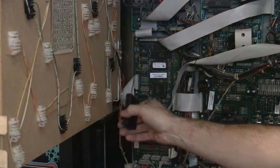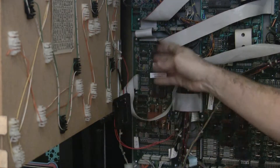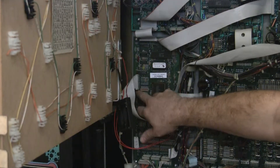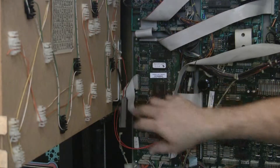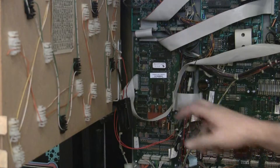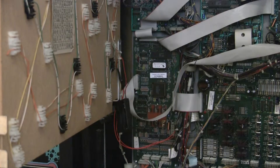I've got my remote battery pack here and we've got the board plugged in. If there's any confusion when you're plugging in these ribbon cables, you'll notice that there are numbers at either end — either it'll say 1 or it'll say 23 or 24. The red line on the ribbon cable always corresponds to pin 1, so if you have trouble figuring out how it's oriented, remember that the red line goes to pin 1 and it'll be indicated on the circuit board.